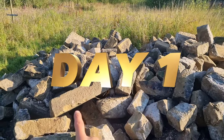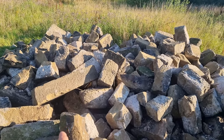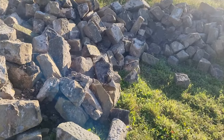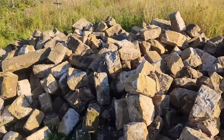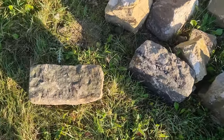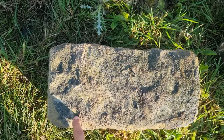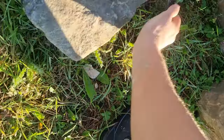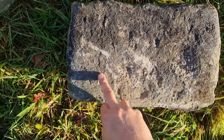This is a stone that I will be backing off to four and four and three quarters — so 100mm to 120mm on the bed — and then I will be coursing to quarter of an inch increments. The stone is a punched face.